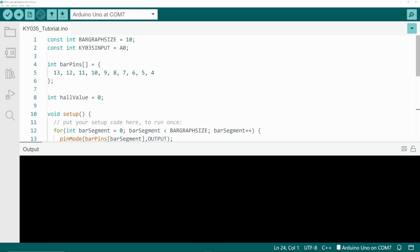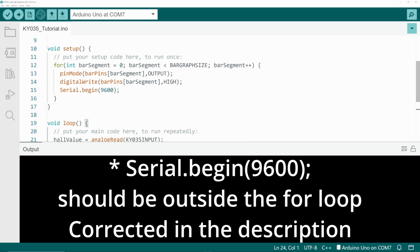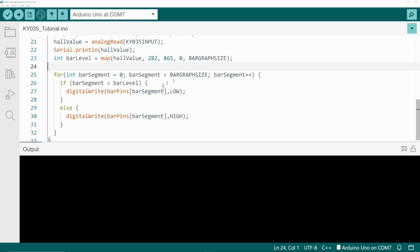Here's a test code we've made, which is in the description below, so you can copy and paste it into your project to get you going quickly to test your own KY035. We set up the bar graph display here, which pins it's connected to. We have a variable for reading the analog value. This setup area sets up the bar graph display, and it also opens a serial console where we're just sending debugging values. In the main loop itself, we read the sensor value, we send that value out to the serial console, we map the value obtained from the sensor, and we normalize that to the 10 digits of the bar graph display, and we then either switch on or switch off the bar graph display accordingly to the value. We loop around that forever.